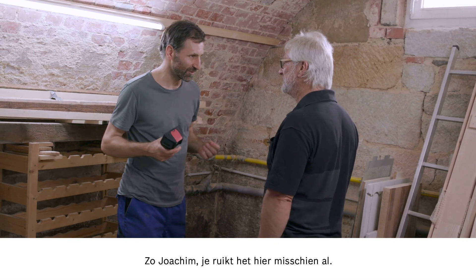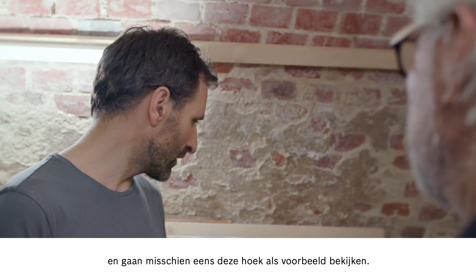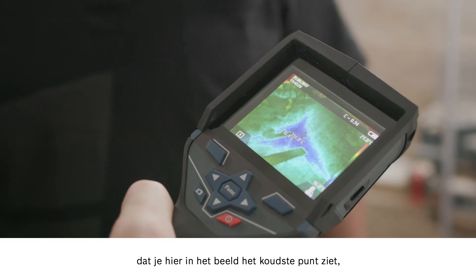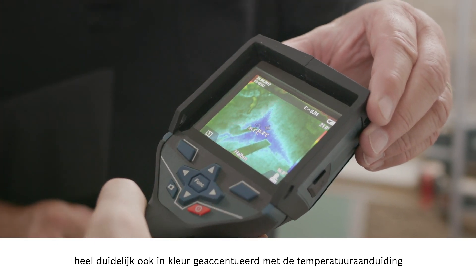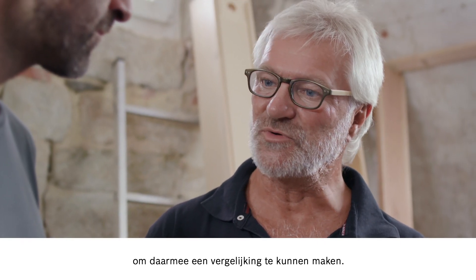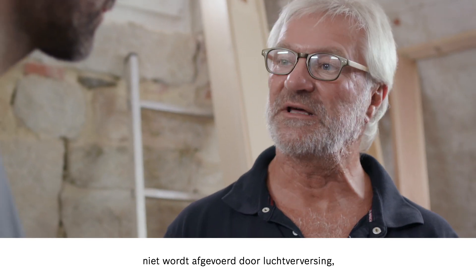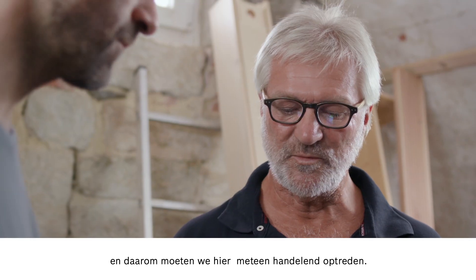You might be getting a whiff of something here — it smells a bit musty. There's a problem with damp in the walls; you can see it in this corner, for example. So now you know what to do — get scanning and then look at the results. The most important thing is that you can see the coldest point in the image, which is clearly a different color in the temperature display. You can also see the temperature around this point in the wall, which allows you to make a comparison. We have a lot of pipes and this room is really cool, which causes condensation to form. If we don't get rid of this moisture through ventilation, we will start to see mold form very quickly — and this mold can be really dangerous to the people living in the house, so we need to do something about this as a matter of urgency.